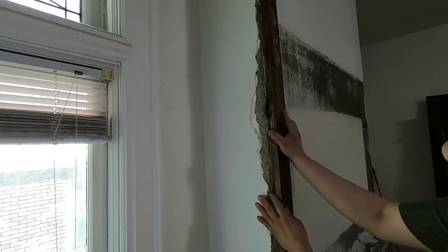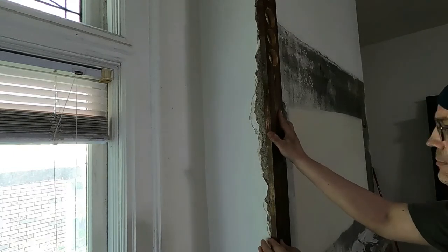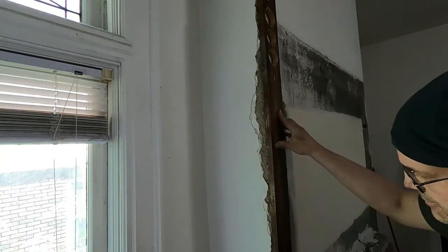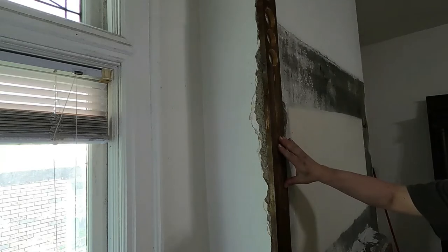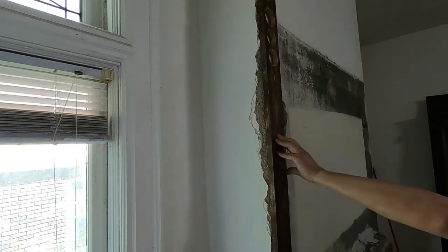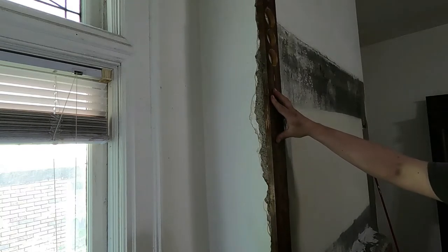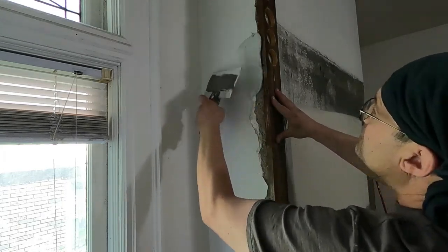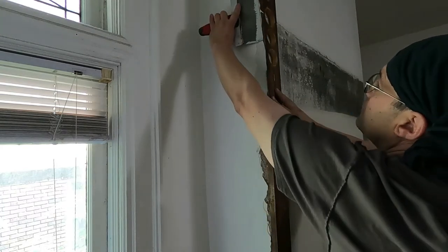Here, we are going to fix an outside corner — an outside plaster corner. It's not really a place where a corner bead or paper tape would be appropriate; again, a metal corner bead would work. So the first thing I want to do is use a straight edge, and that will allow me to apply joint compound and leave a reasonably straight edge.